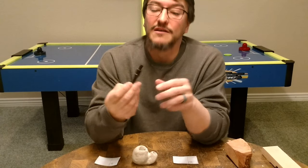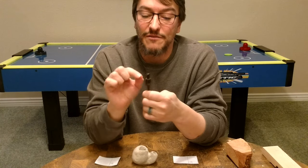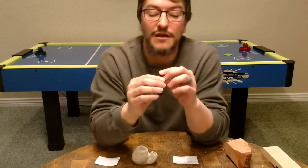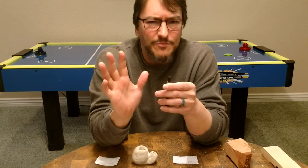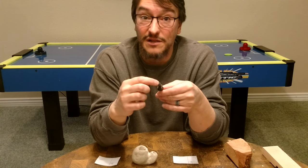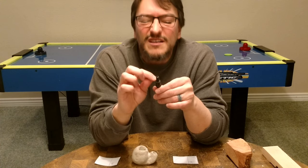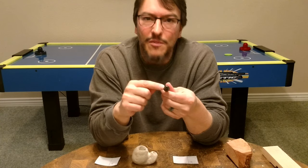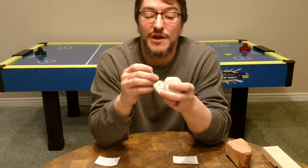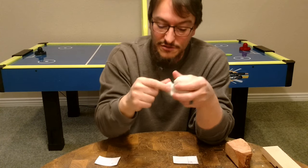It's been problematic. I went over to my buddy Yogi's machine shop to machine this down — the whole thing was wide all the way out. We spent two hours making a jig to hold the piece. This isn't quite perfectly centered, and that often happens — when you buy stems, the holes down the middle aren't always right in the center. So when you turn it down, it's not always right in the center of the stem.